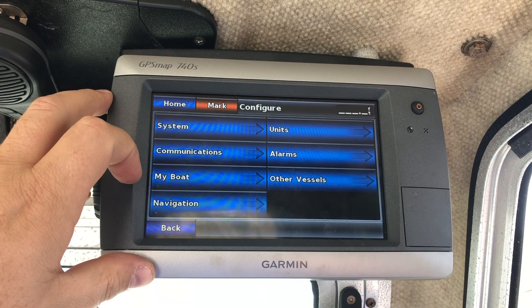One of the other cool things about NMEA 2000 is it's not just limited to navigation or engine data. You can add individual sensors for air temp, water temp, and things like that. You can actually add your VHF radio and AIS — so if you hit a mayday, you can send your AIS position from your GPS over your radio signal. And you can connect your stereo, so instead of cutting a hole in your dash for a faceplate, you can have modules tucked away and control your stereo right off your multi-function display. NMEA 2000 is something I'd highly recommend putting in your next boat.